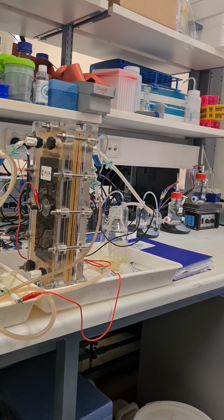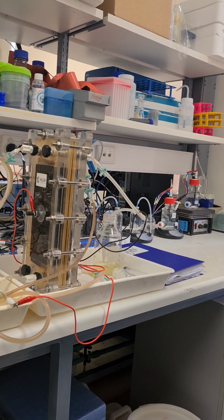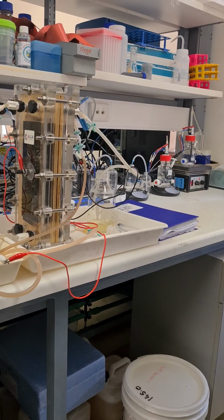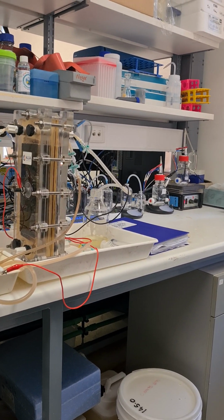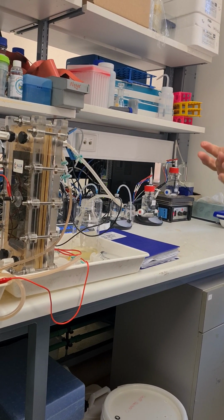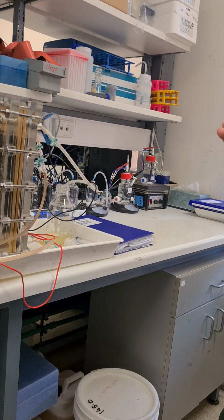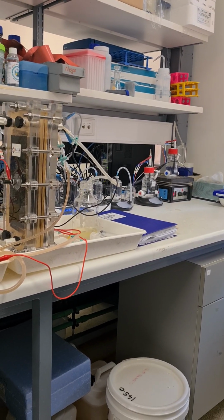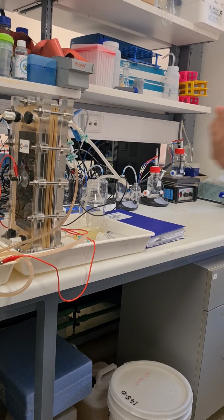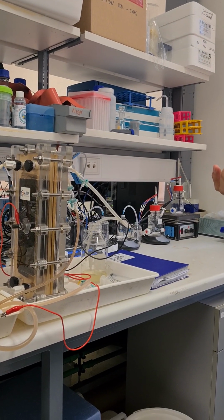So it's about 0.4 LMH. It's very, very low, yeah? If you're looking at it from the LMH point of view, yes, but really we want to reduce the LMH. We want less water. It's really because it's electrodialysis. We want more nutrients and less water. So we are happy with low LMH if the nutrient flux is high, because this is electrodialysis, not RO.